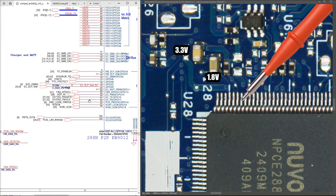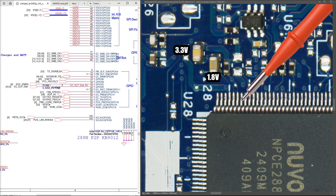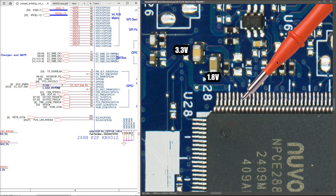Next I want to make sure the Super I/O chip is receiving the power button signal. Looking at the schematic, pin 122 is our power button out. Counting down from pin 125: 125, 124, 123, 122 - this is our power button pin. Without pressing the power button I measure 1.8V there. When I press and hold the power button it drops to 0V, and when I release it goes back to 1.8V. That confirms the power button signal is making it all the way to pin 122 of the Super I/O.